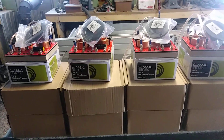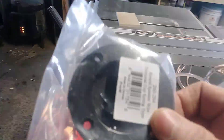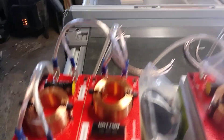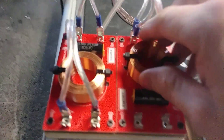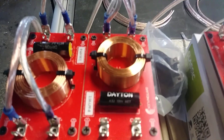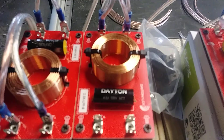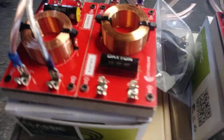He's not a real big bass head, but he does like good clean music. Here's the cheap terminal cups — good enough for a shop speaker. These are my crossovers. I like to mount them on little MDF boards so I can just hot glue them in place and pre-wire them. I've still got to make the cables for the six and a halves. Dayton offers a couple different sets of pre-made crossovers, and I haven't built crossovers in years — I don't even know where my chart is. So for me, it's just easier to buy them.